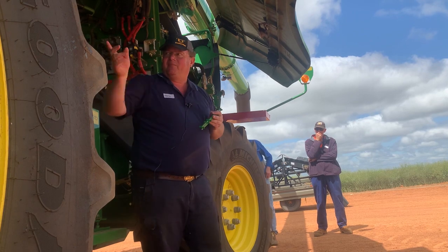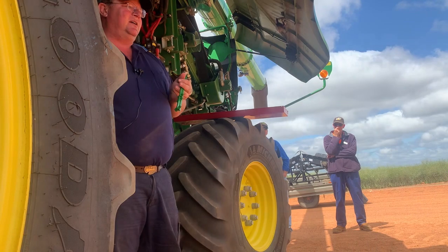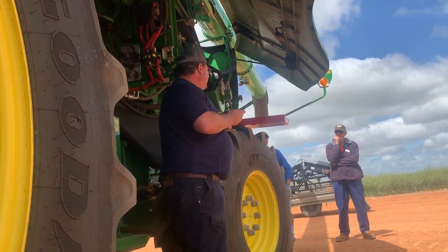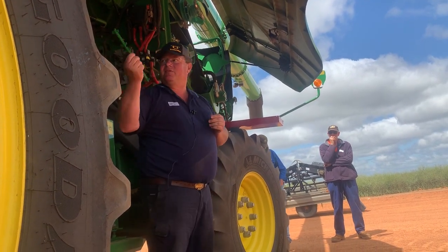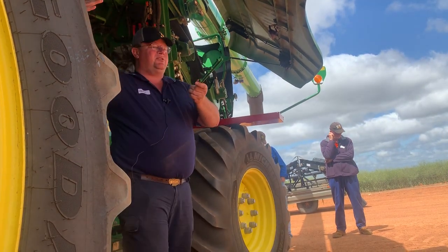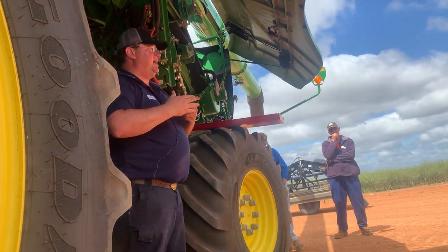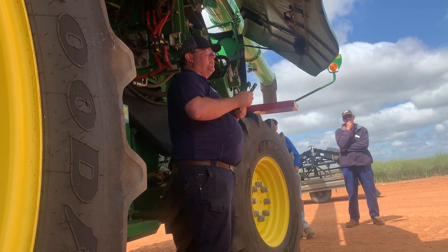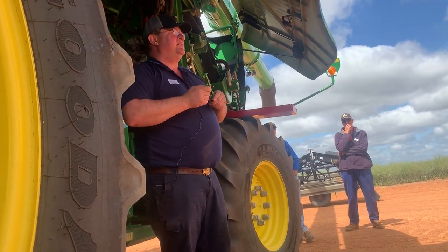Right? If we go back to our concaves, one thing we talked about, the convex concaves. I've done a lot of work with a helical concave. So it's a concave where these bars are sitting like that in the concave. So when you look at the machine, instead of sitting like that, they are sitting like that. So as our material comes in, it hits it on a 90-degree angle. Right? So those bars, those concaves are really, really heavy to swap out. You don't want to work with that 5 times a day,